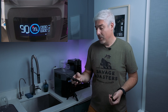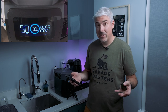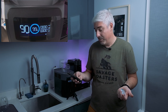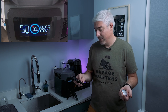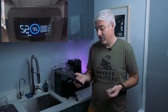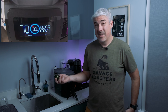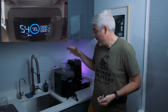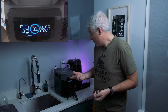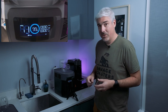So I'll start out with the mobile app. I'm going to turn on the AC outputs of the EcoFlow — right now they are not on. And if you watch my full EcoFlow Delta II review, you'll see a complete test, everything described, and a little bit of the app action. You can turn all the outputs on and off, which is pretty helpful. So I've gone to my outputs and I am clicking on the AC. When you hit the button, it does take a half second to respond. But now it's on and you can see the battery life estimate has gone down a little bit. The inverter, which turns the battery's DC power into AC, has a little bit of a draw just to keep itself alive. So right now it's drawing zero watts.